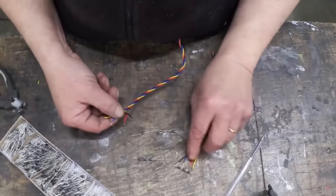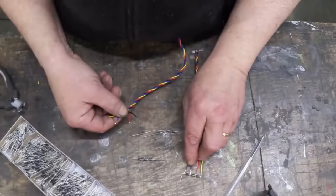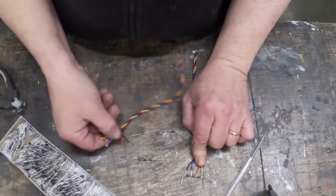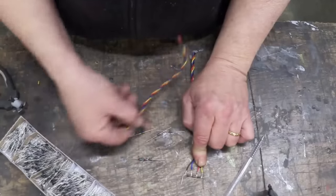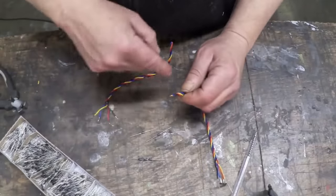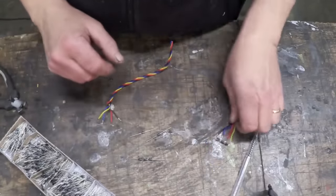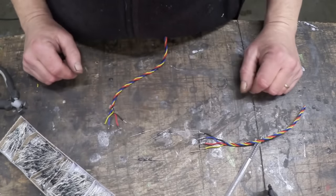In order to put 64 capacitors on our fractal net, we need 32 of these, because each one takes two capacitors. We solder the same wire in the same place all of the time. Here's an example of one that I've got ready — position one is black, position two is blue, position three is red, and position four is yellow. I need to solder them all the same way every time: black goes there, blue there, red there, yellow there. As long as I make 32 identical to that, then I can solder black and red to one capacitor, and blue and yellow to the other, when I form my fractal net.